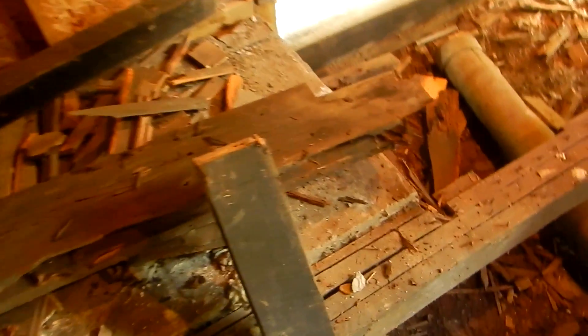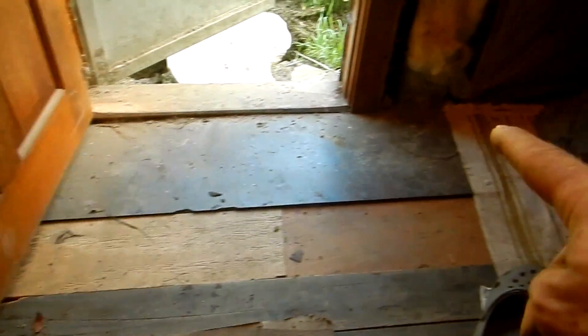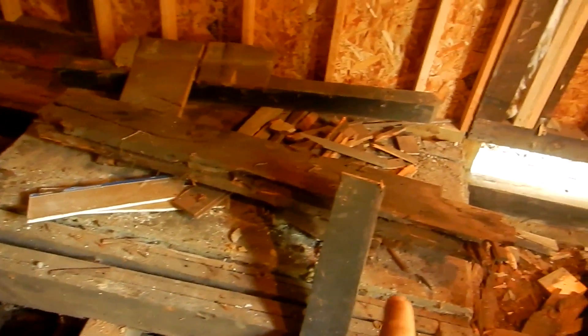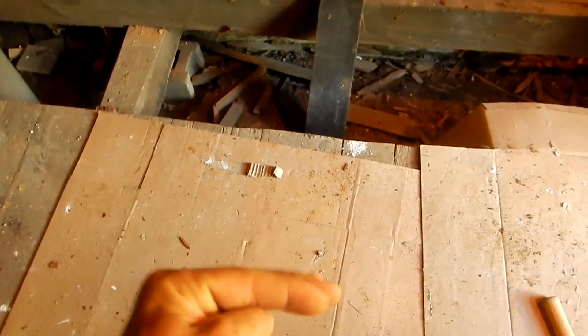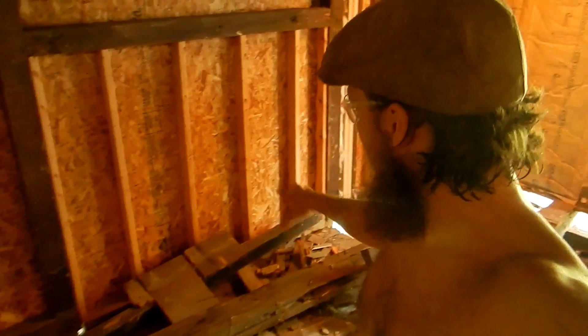Now I'm going to finish up this old floor. All of the wood in here was just rotten and bad. There's the sill plate up front that's good; here's the one I'm replacing. The floor joists — I'm going to do new floor joists around the rock for the chimney, then back here eight-foot joists, and I'm going to replace it with sheets of three-quarter plywood to get a floor built up in here. That way I can get the wood stove moved over here onto the rock pad so we have heat for this winter.